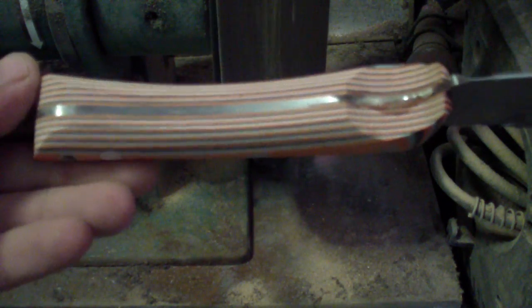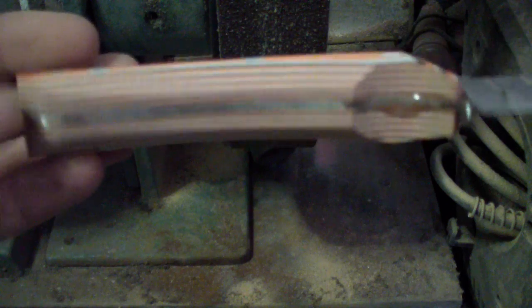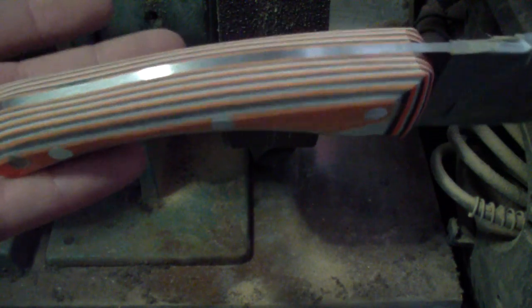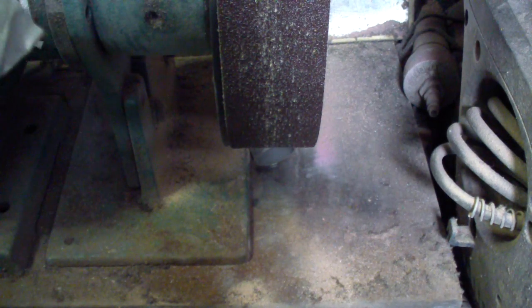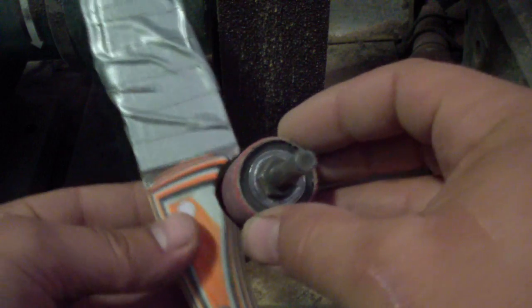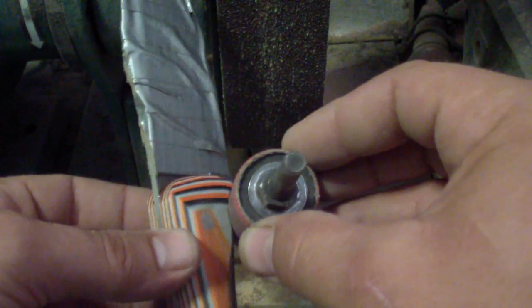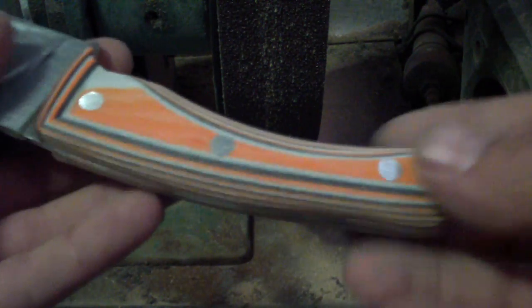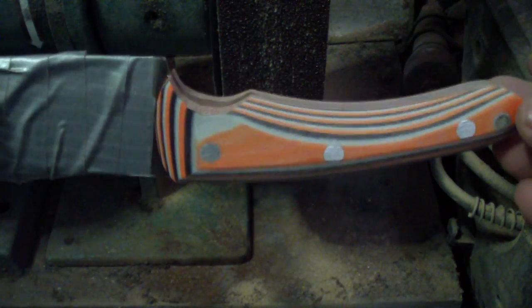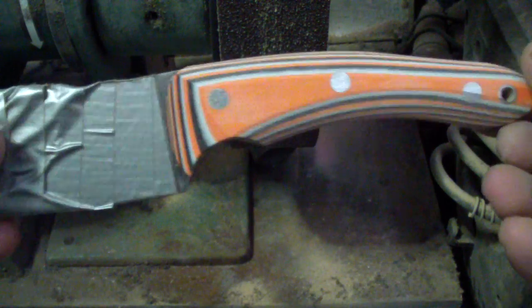Now you see, this is just the rough, the first portion of the job. If you were going for just a simple working handle without any bells and whistles, once you clean it with the sanding drum, you can do this with the Dremel, you can do this with these sanding drums. There's a lot of different ways to do it. This would be the right size for this one, cleaning in this and then doing it on the angle to do the finger groove, nice for the index finger. But once you do that, it already is a very, very comfortable functioning handle.